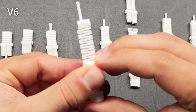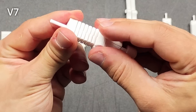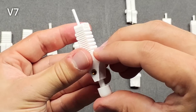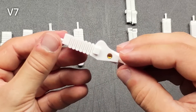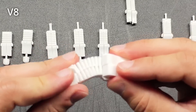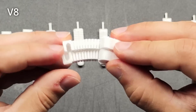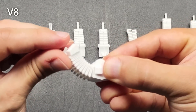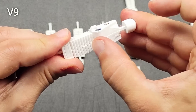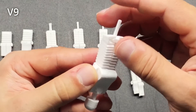I also made the spring looser by making the entire spring thinner. Finally — this made a huge difference, but it was still too stiff. After making the entire spring more narrow so it would fit in between the tibias a bit better, the last thing was to figure out the optimal spring thickness. I created three new spring designs, each thinner than the last. I ended up going with the thinnest one, since the other two still took too much force to press down. The new spring thickness was perfect, which is good since I don't think I could make it any thinner.